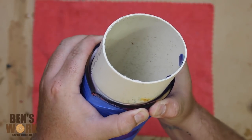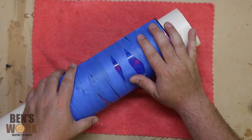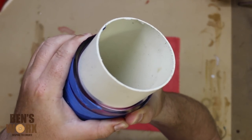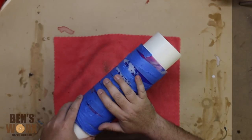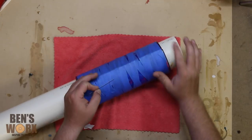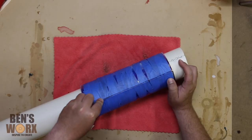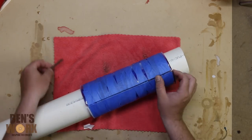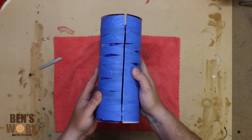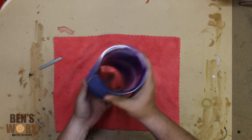You can see the movement here in the pipe — I'll leave this for about a week then come back and check it, hopefully it's gone nice and hard. I let it sit for four days and you can see now that when I go to squeeze the pipe there's absolutely no flex, which means the resin's gone nice and hard. I'm just going to blade this tape off — I am expecting it to open up a little bit, hopefully not too much. Wow, that didn't open up too much at all. It's held its shape really nicely.